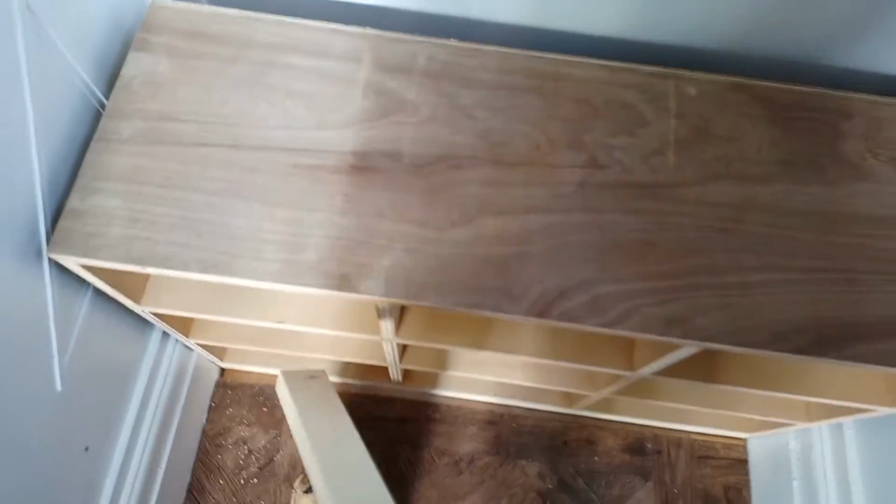And I want a little bit more depth for the seat, and I need to cover the floor, so I've got about 2x1 depth, so I'll put a batten along the back wall here, put a line like that, take this out, screw a batten to the wall.